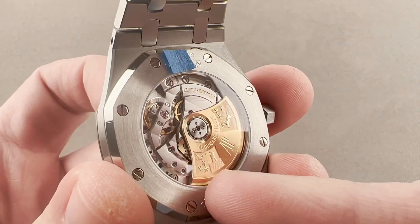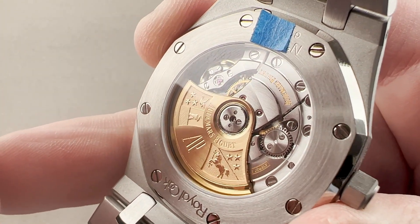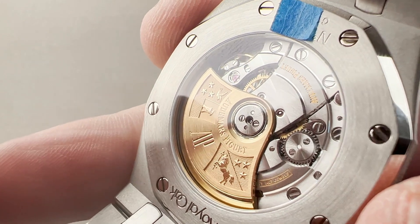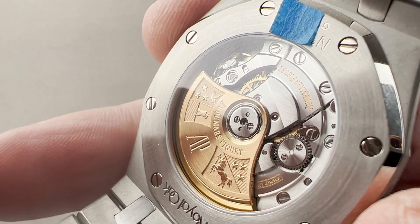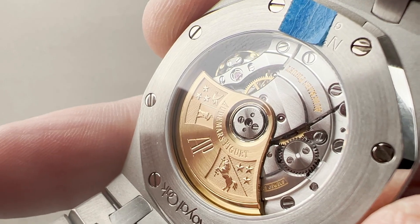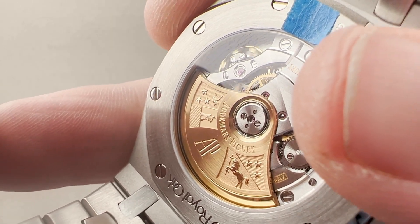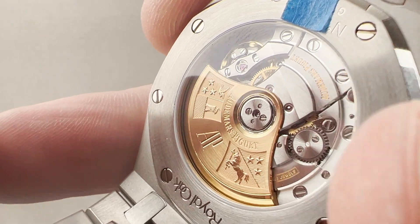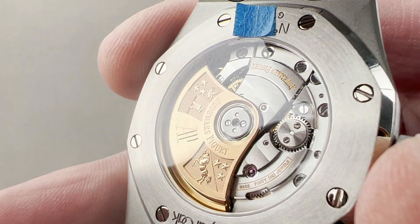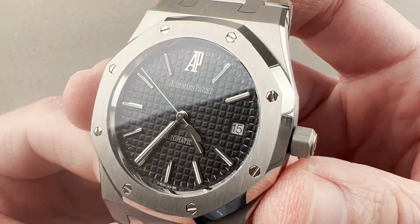On the reverse side you can see the Audemars Piguet caliber 3120. Automatic winding with bidirectional action, it has ceramic rotor bearings for improved efficiency and reduced maintenance needs. The rotor features the coats of arms of the Audemars Piguet family, reminding you that since 1875 Audemars Piguet is the oldest family-owned and run watchmaker in Switzerland. We have a 60-hour power reserve, stop seconds, and quick-set date. There's a full balance bridge with an almost batwing profile, and a free-sprung gyromax-style balance for precise adjustment and shock resistance. It beats at 21,600 vibrations per hour and pivots on 40 jewels, featuring a handsome combination of both manual and mechanical finishing — a medley befitting the image of Audemars Piguet.